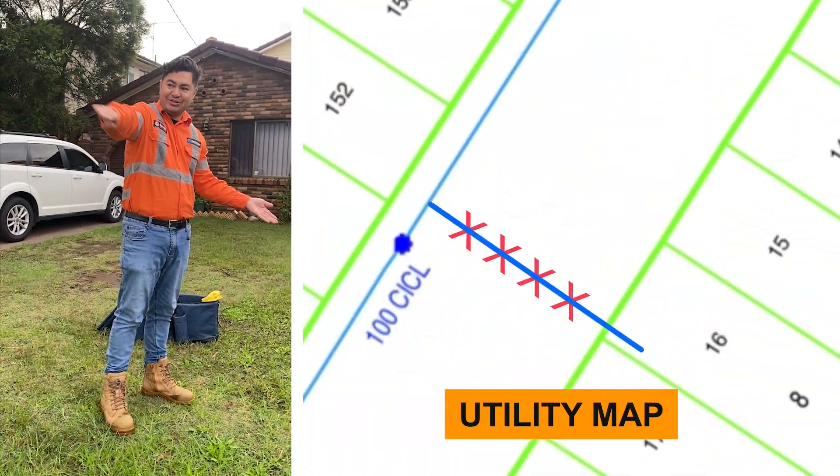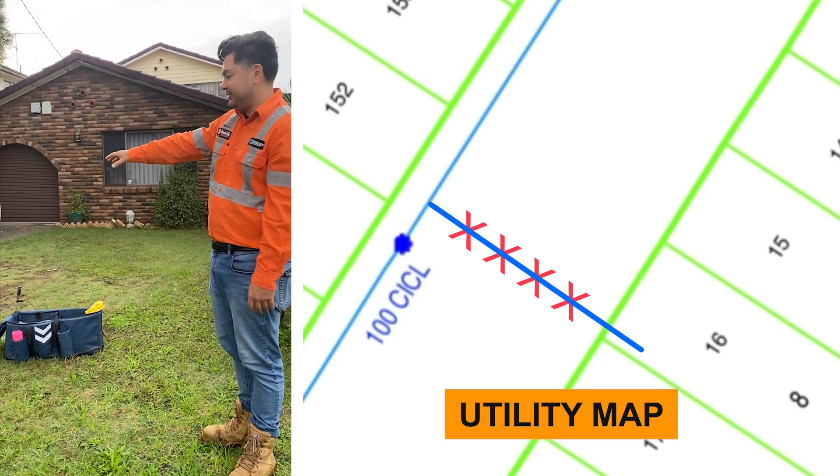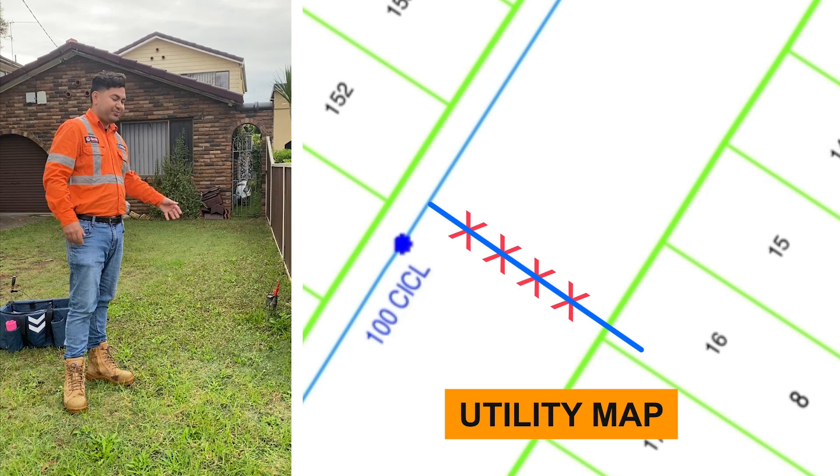So now just dotting it — and around about here we go. I think we know what's going on: the water meter has been moved. I assumed this pipe would come 90 degrees out to the road, but it looks like at the other house they had a meter in the middle of the property, maybe got hit by a car, so they've moved and relocated it away from the traffic. So we're going to pick up the bag, transmitter and leads and move our connection point — again 90 degrees to where we now know it is.